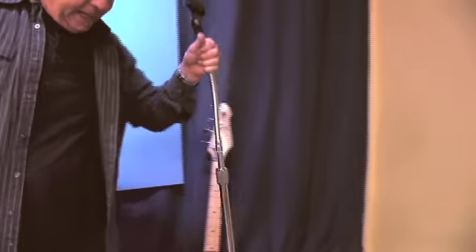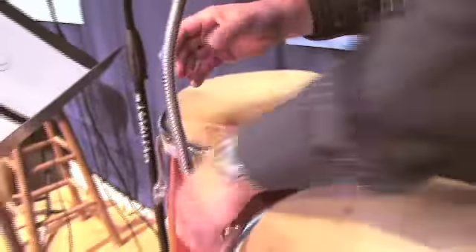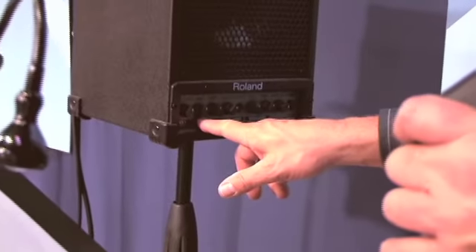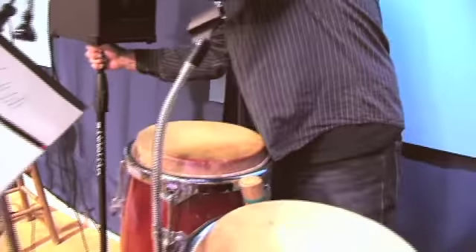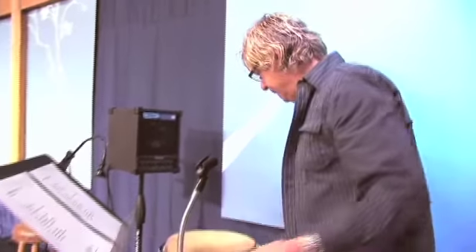There is normally a microphone here — usually a boom mic — and the player usually has their music stand right in front of them. We have to be careful to watch cube monitor number 4, which goes with the percussion area. The only channel controlling how loud this microphone is will be number 1, so watch where this microphone is relative to the singer to avoid feedback. I usually have it angled a certain way to avoid feedback — the more you turn the microphone toward the monitor, the more it will feed back. So keep that in mind when setting this back up, and keep it close to save stage area.